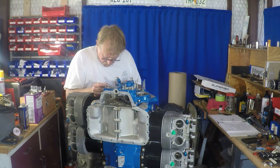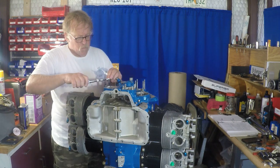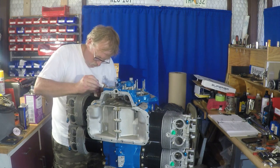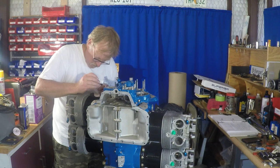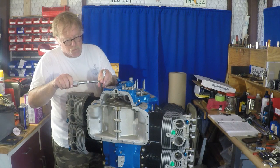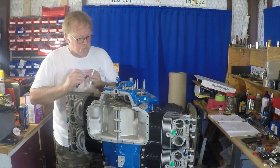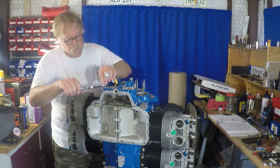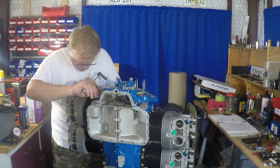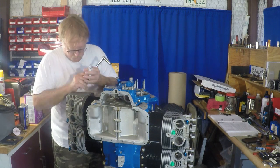And then just going around, no specific pattern on this, just kind of coming around the horn, so to speak. Start in the middle, top, and then that's, again, just the way I do it. Start in the top and then come around and bring it all down one side. And the torque seal is keeping me honest, knowing that anything I torqued, there's a witness that I did that. So I kind of like to use this stuff. You can get all different colors. You can go white, orange. I typically use white or orange when I'm working on stuff.